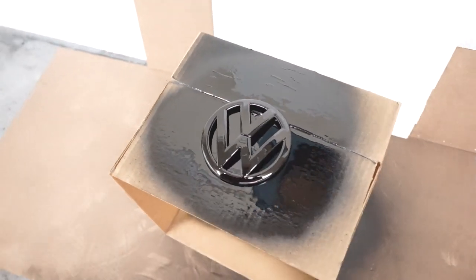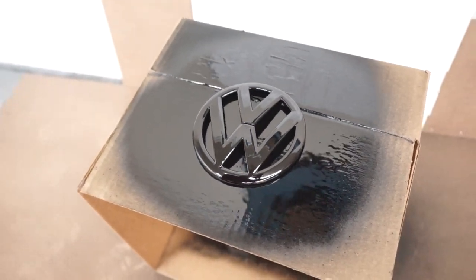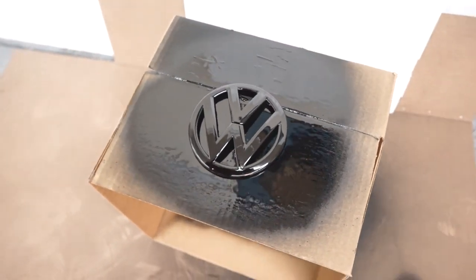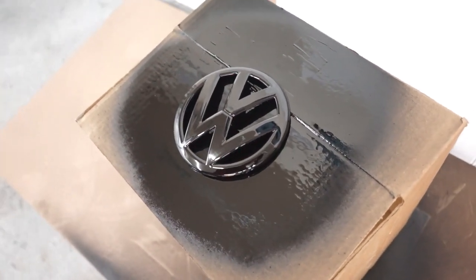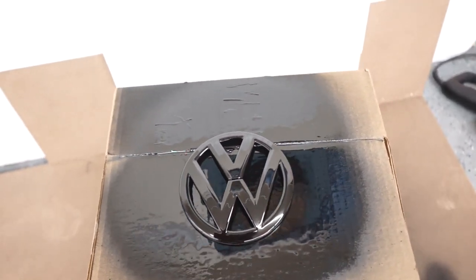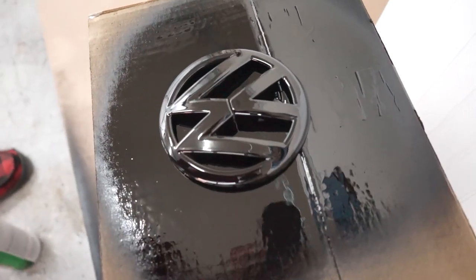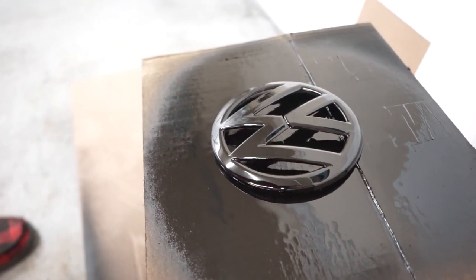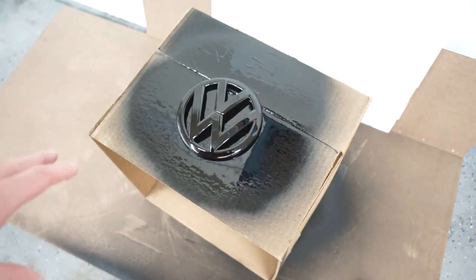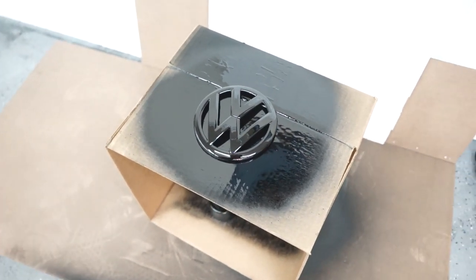The final coat is on. I like to lay it on pretty thick with this lacquer because it's really sticky. If you get everything hot enough you can really lay it on and it gives a really nice glossy finish. As long as it's hot and you hit it with the heat gun really quickly after spraying, you tend to avoid any drips. I really like the way this is finished — nice and glossy with a little reflection. I'm going to let this dry for a while because it will show fingerprints if you touch it, then we'll get back to installing it on the front.